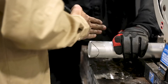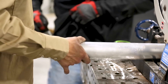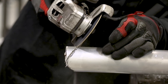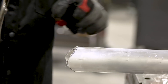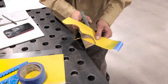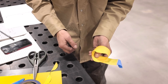So we could just take the grinder into it, cut triangles out of it and then go ahead. Let's cut the fish mouth on this because we've got this thing to hold it for us. So after we clean that cope up, we're going to take it over to the plastic folder we have and make that into our template so we can wrap it around the pipe we're using and trace around that.